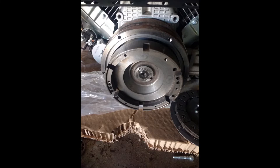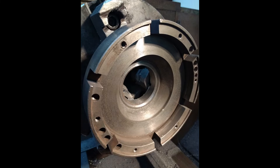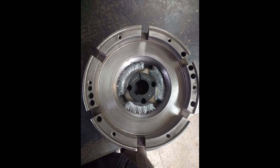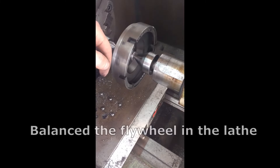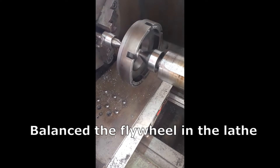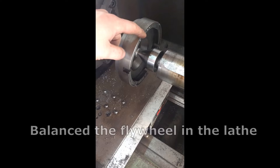The old motor had a conical shaft, but the new motor has a 25mm straight shaft. My first idea was to weld in a bushing, but I couldn't get it secured on the crank. So I found a better option and welded in a taper lock, and this works perfectly. The flywheel had a really bad casting, so I turned it down to where it was nice and even. Afterwards I balanced it on the lathe with two rotating centers — seems good for at least 7000 rpm I think.